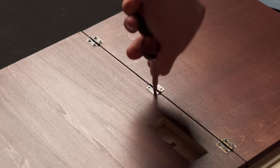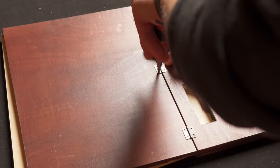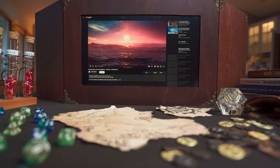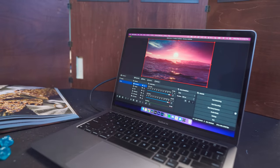The last steps are to screw in the hinges, add the little corner decorations, add some adhesive magnets to the back — which also cover up those varathane marks — and fire it up. After putting on the hinges and finding out that it just barely closes, I realized that making the side panels exactly half the width of the front panel doesn't leave any room for error. I've revised the plans in the description to make the side panels 22.25 cm wide instead to ensure there's a gap in the middle. The finishing touches are these decorative corner pieces that I put on with super glue — these little details really elevate it and make it look finished. I chose this monitor because it's USB-C, which means I can power it and send an image to it using just one cable. These little right-angle USB-C adapters fit in the spaces that we cut out to keep everything tidy and compact.